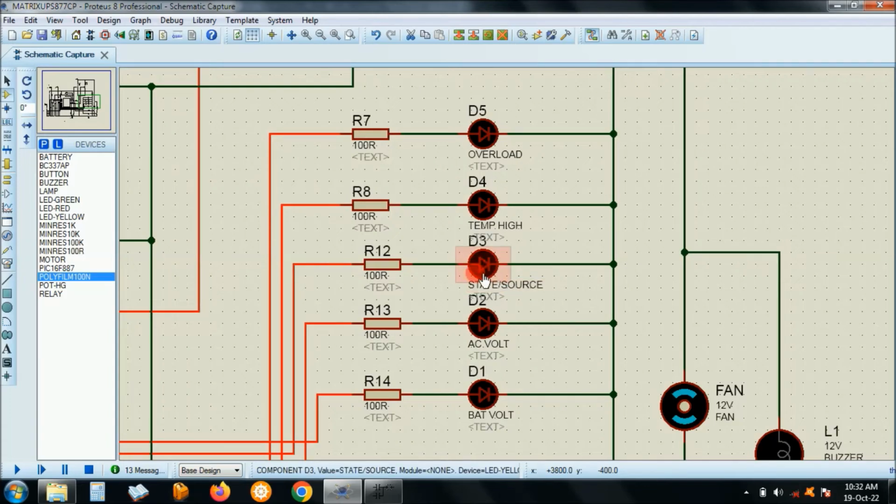This is the LED that, even if it's just off, it's always running, depending on the source that you select. When it's in solar mode, it's flickering fast. When it's in battery mode, it flickers slow. And then also that's 3/5 of the supply level. And then this indicates the temperature high, or when you have over temperature, it indicates the temperature, and that's 4/5 of also supply. This is overload, or 5/5 when the battery is full, or the battery solar supply is good enough, okay, to the max, right?